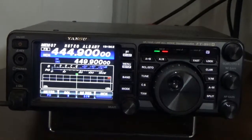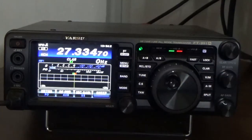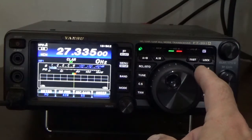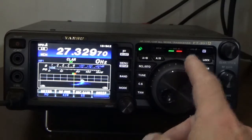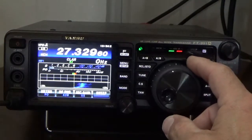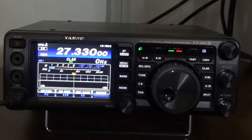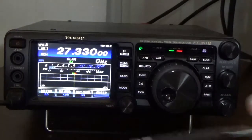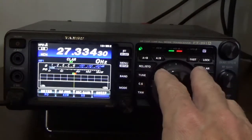What I wanted to show you today — we have some traffic here. I'm listening right now on 27.335. I don't think there's anybody on right now; we had some traffic earlier. What I'm going to do is purposely tune off the frequency — basically 5 kilohertz lower than the resident frequency of 27.335.